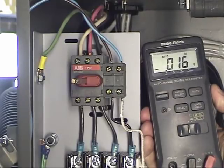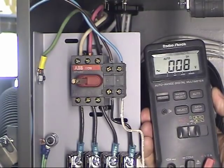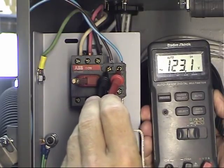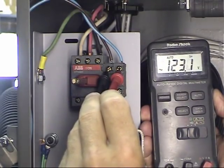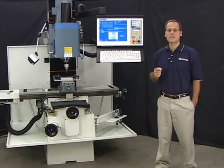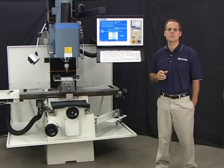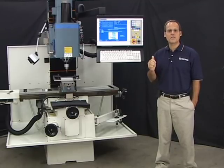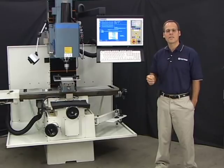This particular machine is also a dual voltage input machine, so it has 110 volts coming in through the switch as well. Checking the top of that terminal block, sure enough we have 120 volts AC coming in. Centroid CNC controls run off single phase or three-phase power. Because of this, we strongly discourage the use of a phase converter — with a Centroid, that's an unnecessary expense and may even cause damage. If you only have single-phase power, no problem.